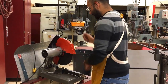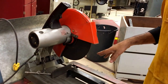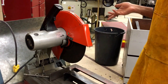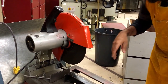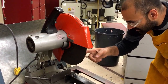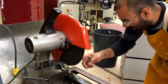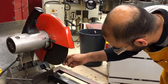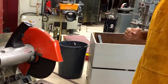Next, make sure the blade is safe to use. You have no control over what other people have done with this machine — someone during lunch or in a previous block may have used it improperly. So we inspect it before use. With the machine unplugged, spin the wheel and look for any cracks or big chunks missing. On the edge of the wheel, look for anything that resembles a bright shiny metal stuck to it — that could be soft metals, which are dangerous to have stuck on the blade.